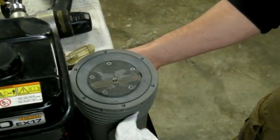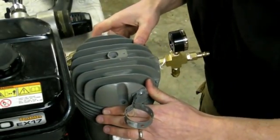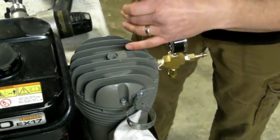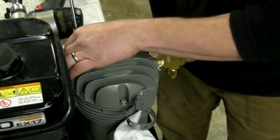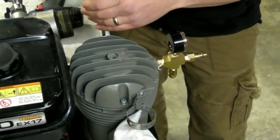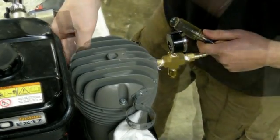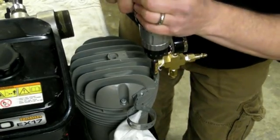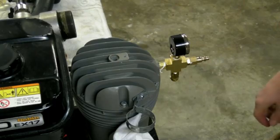That's back on. Now we can put the head back on. We're going to line everything up. I prefer to use the cordless drill on the screw setting because this head needs to have a certain amount of pressure on it to make sure there are no leaks — otherwise you're not going to be able to build up enough pressure for your regulator while you're diving. So right now I'm just going to snug them all down, and we're done.